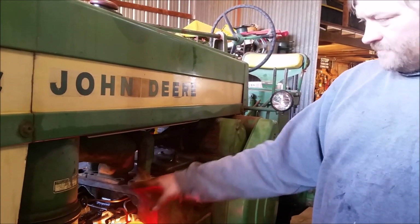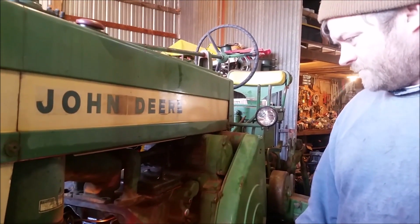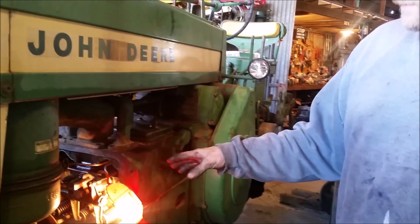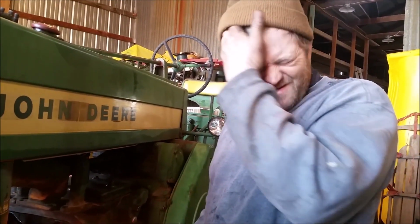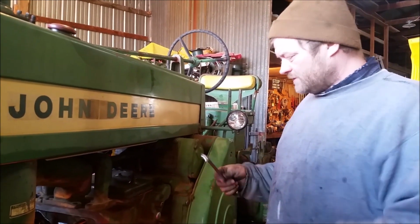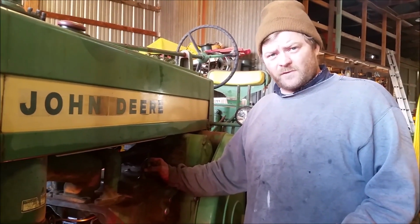We'll take this cover off, time it by that, and then we'll get those adjusted the first time. We have to button up the top, cover on the front, the water coolant pipe in the bottom is still out. Just a few more things, and then we'll adjust the valves and belt start it. We'll let it crank over. All the lines are full of air. Oh, sure. Sometimes it might take it a minute to get its fuel and start. Okay. So if you're starting it with a belt, that's nice. Yeah. You just crank it how you want with the decompression lever, no compression, just let it spin. So it'll be running here in a little bit. Great. And then we'll do some mild jobs with it and then we torque the head. Okay.